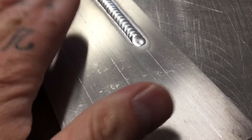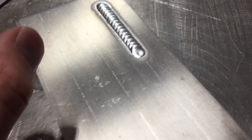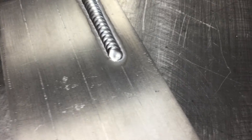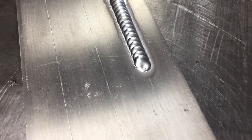I'm going to basically just finish this plate — it's still hot but cooling off quickly. I'm going to tie in and finish it, probably finishing around here somewhere. The plate is going to be very hot by the end so I'm going to have to back off the heat quite a bit and watch that I adjust for it. Let's finish it up.